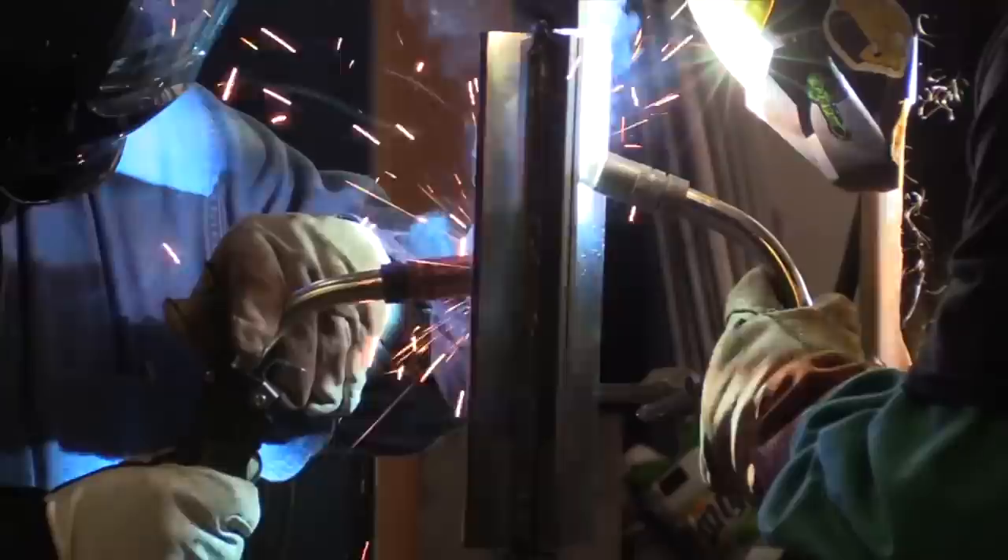I got to be a member of the Black Booger Club during that month. Anyway, in this video I'm burning 3/16ths 7018s, and I'm going to do a multi-pass weld — roughly a three-quarter inch fillet. I didn't have my fillet gauge for this video. I'm going to be thinking about that first job while I'm doing it, and I'm going to try to provide as much advice and tips for those getting started as I possibly can. There should be something for everybody here. Let's do it.